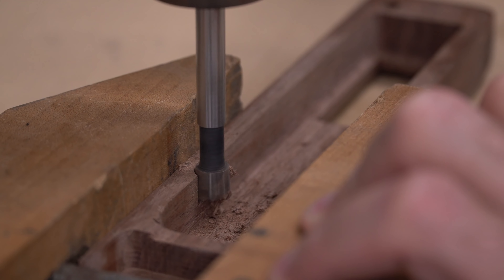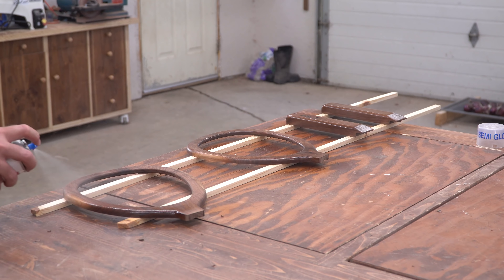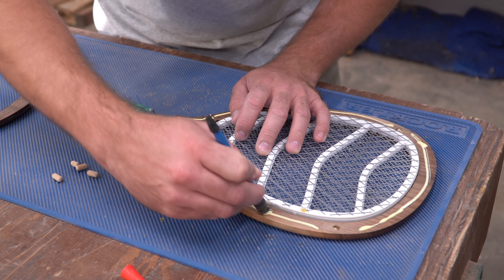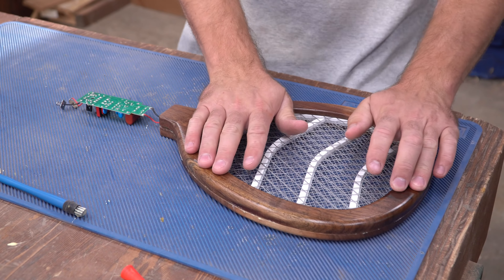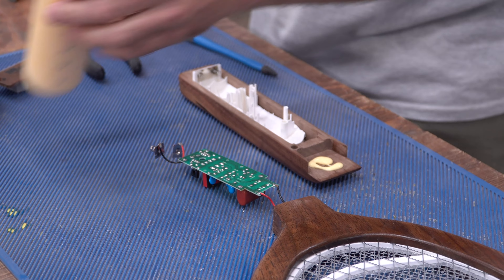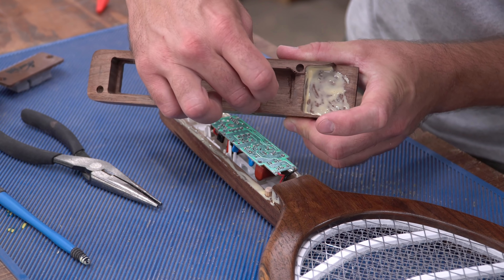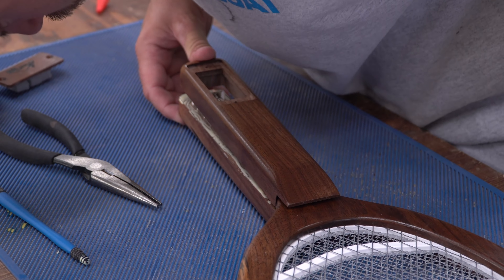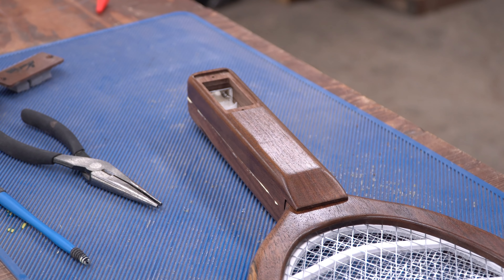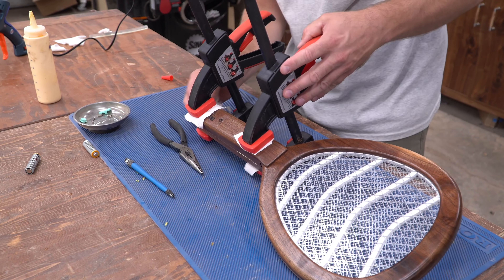I needed to make one last modification — to make a shoulder so my power button could be pushed in but not slide out. I used a Forstner bit to remove most of the material, then squared up the corners with a small chisel. I decided I wanted a more durable finish since this thing might get abused a bit, so I put on several coats of spray-on poly. Then when that dried, I finally glued the whole thing together for the last time. I was very careful to get glue on all the mating surfaces but not to use too much. I wiped up any extra glue that squeezed out onto my finish and used clamps all the way around to get a good solid bond. With the head done, I glued the handle the same way — strategically slather glue, carefully install the electronics, and press the pieces together. I kept glue far away from the power button because it might be impossible to fix if it gets bound up. I considered adding pins between the handle and the head to keep them from ever separating, but this thing just won't ever see enough force to cause that to happen — if I was building a tennis racket, that would be a different story. I used some small chunks of a clean old t-shirt as pads to keep the clamps from marring the finish, then just had to wait for the glue to dry before I could test it out on some unsuspecting flies.